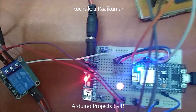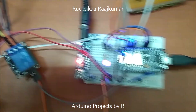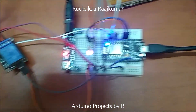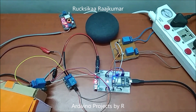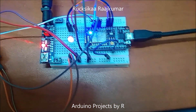You will be needing three 220-ohm resistors. And as this is a common anode RGB LED, this will be connected to 5V. For this project you will be needing the Blynk app and the IFTTT app, also known as the 'If This Then That' app. Now let me explain you the connections.